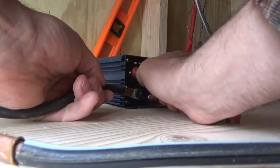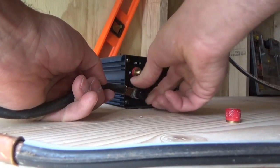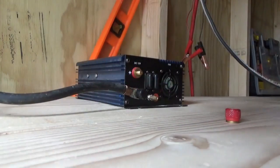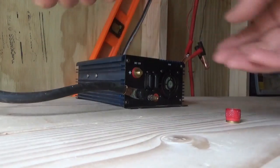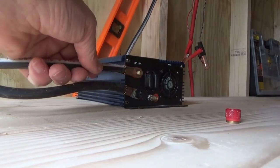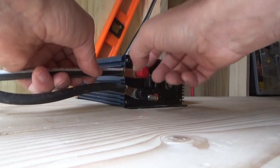You're going to get a little bit of a snap, a spark, when you connect the other wire. There's the negative hooked up to my battery bank — I already had that connected to the batteries — and there should be a little spark. Yeah, there was a tiny spark. It's a little inverter, so now connect the positive to the batteries.